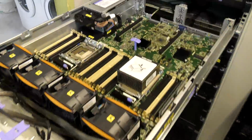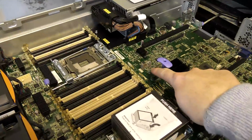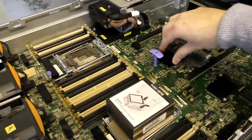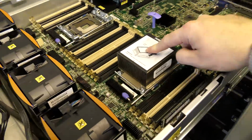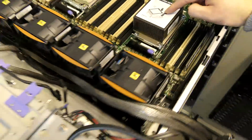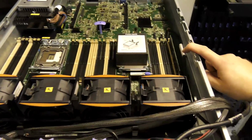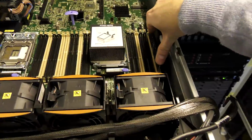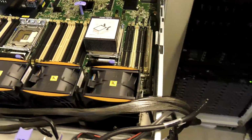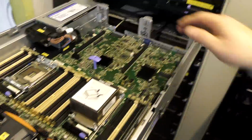Okay, we have the system board in here again, and it's the right system board. I only have one where the battery holders look like this, and it should be good. I put in the 2603, the very low end CPU, and I crammed in 8 gigabytes of memory right here. I hope it's down there. It should be. Feels good, so it probably has an okay connection down there. So let's turn this on and see what happens.